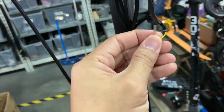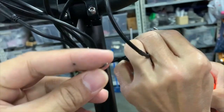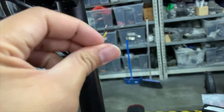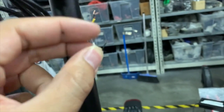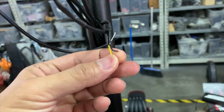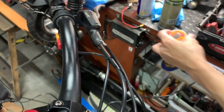Now just join up the two wires. The black joins to black, the white joins to yellow. You can do a direct solder or insert a waterproof plug, but it's better to do a direct solder and then put heat shrink over them. Prepare for soldering — just plate the wires with some solder first.